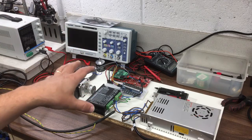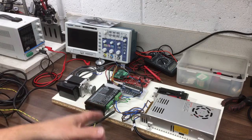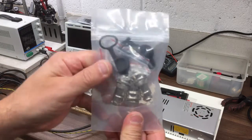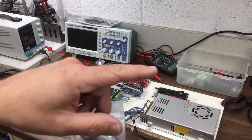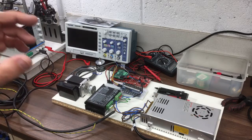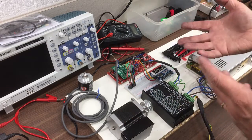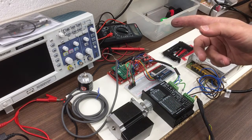The only thing to change is to flash new software for the two millimeter lead screw — that's pretty straightforward. Other jobs: work out how big the enclosure needs to be, make a custom knockout panel at the bottom for through-connectors for the servo, encoder, display, and mains input. I'm also going to have it feed the existing digital readout so everything comes on with one switch. We still need to finalize where the encoder and servo go on the lathe. Still quite a lot to do, but making good progress. Thank you very much for watching — subscribe and click the bell if you don't want to miss anything.